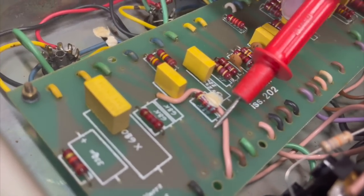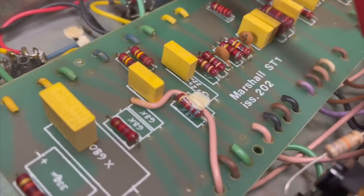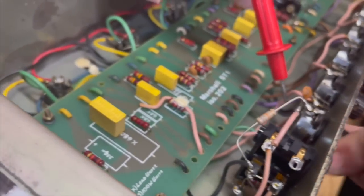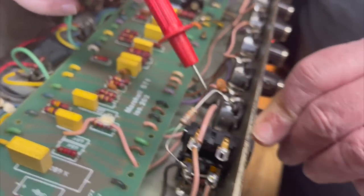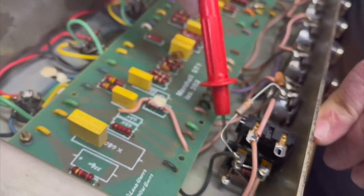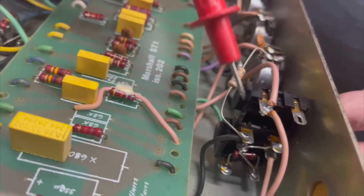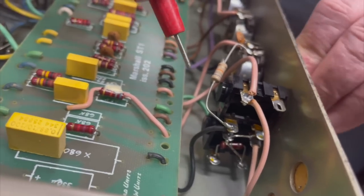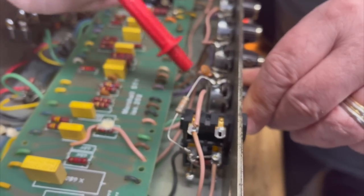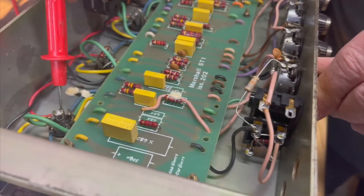And what it is, it's a signal wire coming off of the preamp wiper. So it's taking the signal from the first input stage and linking it into the second input stage, which is what makes it a JCM800, to give you that extra gain stage. And this is the wire going back into the grid of the next preamp tube here.